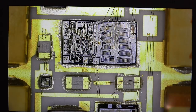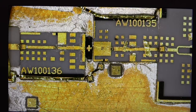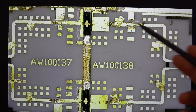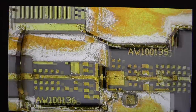Here's a resistor, you can clearly see it. This might be a hybrid device, perhaps another capacitor of some kind, and there is another ASIC down here — potentially for another voltage regulator or some other functionality. Going back up, you can see these tantalum capacitors are massive. And here you can see the ASIC very clearly — the second amplifier stages. There are distributed decoupling caps all over the place. Very nice simple structure, obviously all hand-made and hand-assembled. These look like various trimming components for tuning the different portions of this power divider — a very interesting structure. So much manual work on this — it's crazy. All of this could very easily be done in an integrated circuit depending on the power handling capability — gallium arsenide, gallium nitride, phosphide processes can easily do this, as well as silicon germanium.